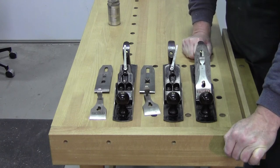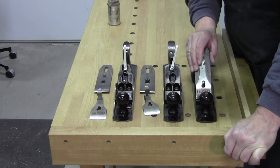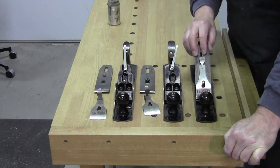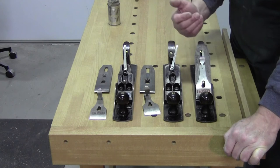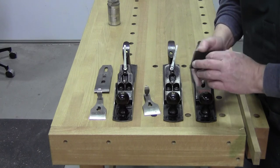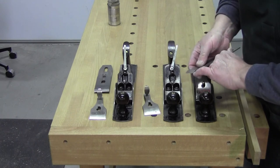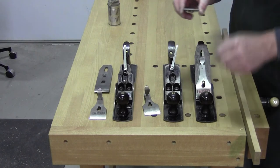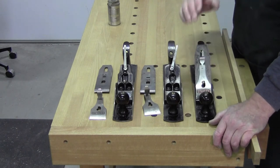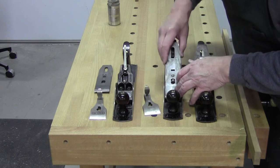So when you find an old plane, you don't have to do this because I say so, but I'm suggesting try this. Do nothing to your plane at first. Take your blade assembly out. Sharpen the bevel. Flatten the back. Make sure that your chip breaker is meeting properly. Any questions on that, write me. Return the blade assembly, or as they are sometimes known, double irons, back to the plane.